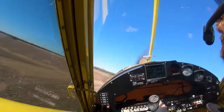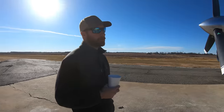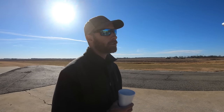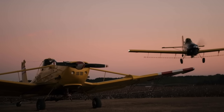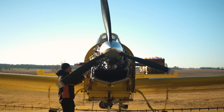How much in-house work do you have to do to get something like this bolted to an airplane? In the future, the plan is it would come here and you literally unbolt the 1340 — take four bolts off — and bolt this frame on there. There's a little bit of modifications you have to do to the firewall to hold the FADEC, et cetera, expansion tanks.